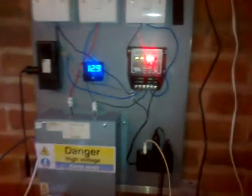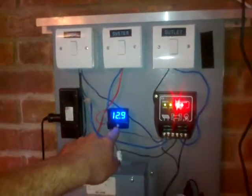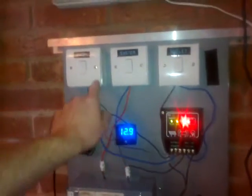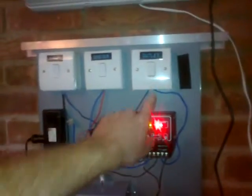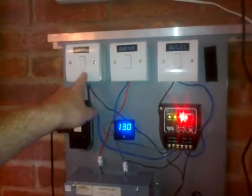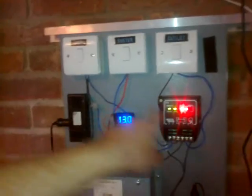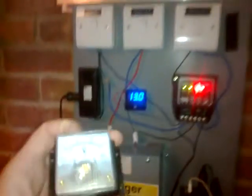Today in the shack we're swapping out the LED volt meter because they chew power. I found that out when I used to have three - one for power in, one for what's in the bank, and one for what was coming out. I realized they were just chewing the battery up, especially with the amount of amps coming in - most of it was feeding the LED voltmeter before it was actually getting to the charge controller and the battery.